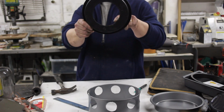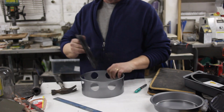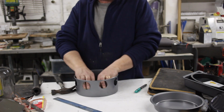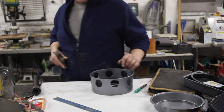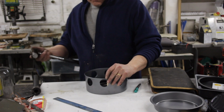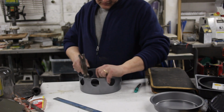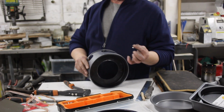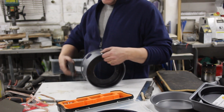Okay, you've done that and you've made your beautiful round edges, it's all folded over, you've bent that edge, then we need to shove it in there. Now it will be a tight fit, which is what it should be because it's springing around, and then with the aid of your trusty hammer and a bit of wood, we can force that edge down. Okay, so it might hold itself, it's certainly got quite a bit of spring, but it doesn't hurt to put a couple of pop rivets in there, and so I put 4 pop rivets around the edge of it.